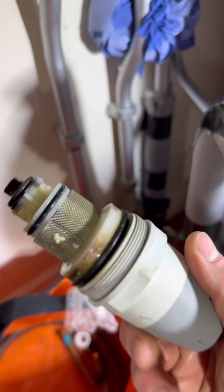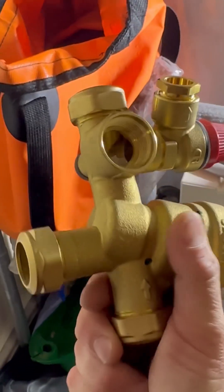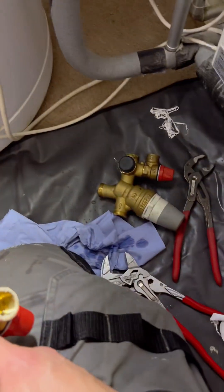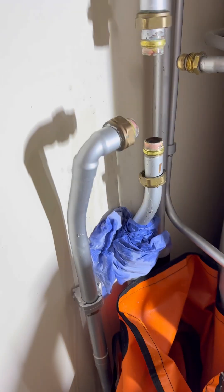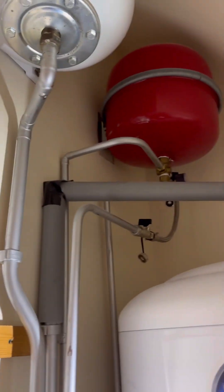So that's your line strainer and your pressure reducing valve all inside there. It all looks okay, but it must be that at fault so we're going to change the combi valve. What this valve does - if you don't know - it's got a line strainer to stop any debris getting in, it's got a pressure reducing valve that drops the mains water down to 3 bar, and it's also got non-return valves for backflow prevention, which is more of a water regs thing than anything.